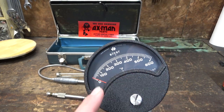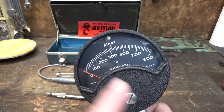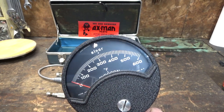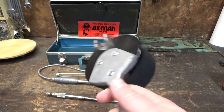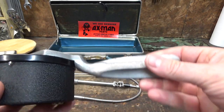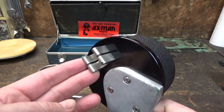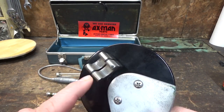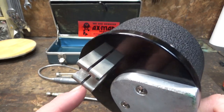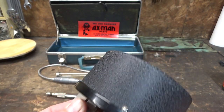It's obviously some kind of thermometer because it has a Fahrenheit dial. 'Pyrocon' hints to me that this is fire- or heat-related, like the pyrometer. The main unit here is very simple — there's the dial, a little adjustment, a handle, and not much else. There's this interesting clip here, and I'm noticing it's in two pieces with little insulating spacers in between. I bet these are conductors — I bet this is two parts of an electrical connection.